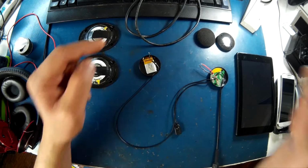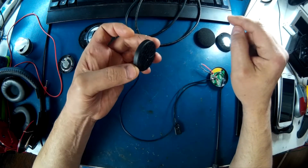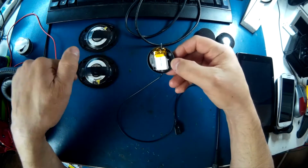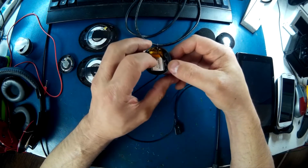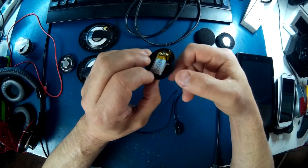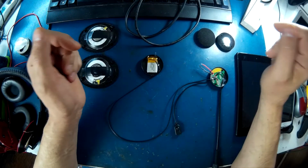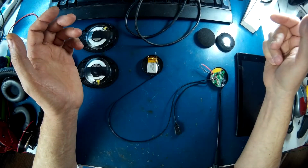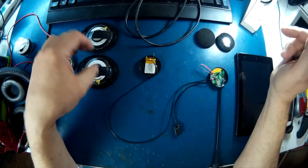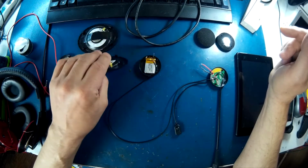So what I'm going to do is I'm going to run this on the back side of the helmet with Velcro, and then I'll run another thin wire like this in for the speaker. That way the dangerous part of this whole device is on the outside of the helmet. If there's any issues with the battery, it'll vent and nobody gets hurt. So that's about it. So I'm going to set this on the outside, rewire it. I'm going to epoxy that, and then we're going to add the really nice drivers on the inside of the helmet.